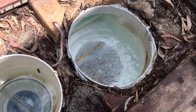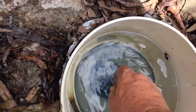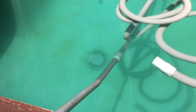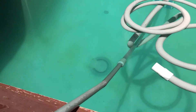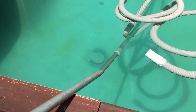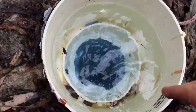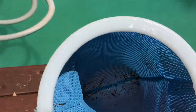This is something that's reversed in a Jandy system. This skimmer here, with a clear little dome lid on it, is the one which is sucking for the filter. It's drawing from two suction points at the bottom, so as the jets pop up and blow the dirt around, the dust and muck gets sucked up into those floor points. The domed lid comes out, and inside there's a large long basket which is really good for catching all the muck.